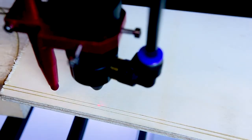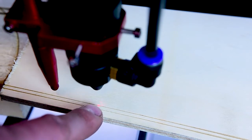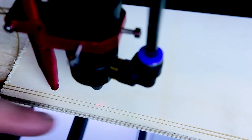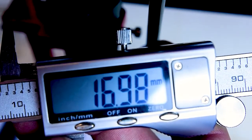This is where it may become apparent why I wanted to spend the money on the red dot — it was only 50 US dollars — and now I have a red dot exactly where the laser beam has hit. So for lining up pieces of work, this is just awesome. What we've done with this focus ramp is create basically a profile of the beam. I'm trying to figure out where the narrowest point is so we can measure where the focus is going to be. I've got that set where I think it's pretty much the narrowest — almost bang on 17 millimeters. I'd call that 17 millimeters as my focal depth from the bottom of the air assist nozzle.